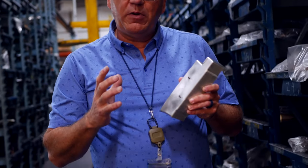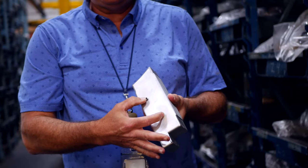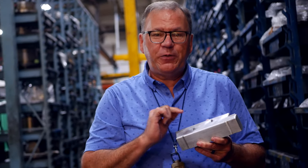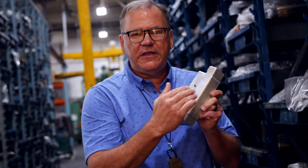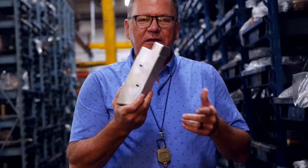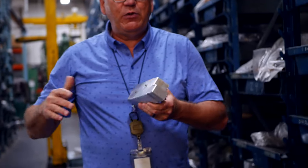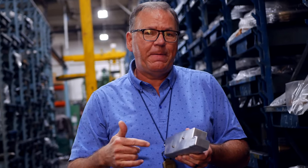We call this type of work form block work. You're basically taking a form block made out of aluminum with a couple of locators in the center of the part, and the pressure of the hydroform bends it over. The reason you wouldn't press-brake this is because there might be a joggle in the part that causes a different shape — you can't do that on a press brake. But the cost of this tool is very minimal compared to what stamping would have to build. Whenever you're doing a form block type of part, hydroforming is a huge advantage.